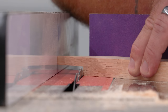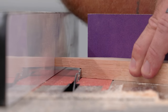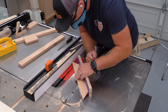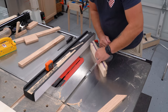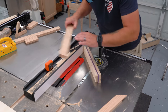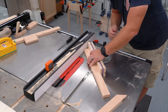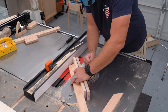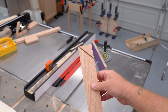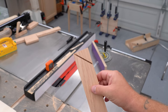It's really important to take your time and make sure everything is just right before making any cuts. Like most things, proper setup will definitely yield better results. With everything set, I'll replace the mitered piece with one of my longer pieces and make a cut all the way through, again using a scrap piece to prevent tearout. What you should have at this point is a mitered cut that only goes halfway through the material and exits perfectly on the corner of the work piece.